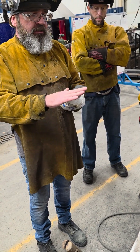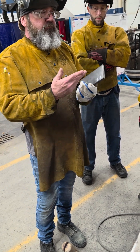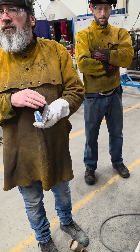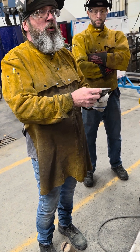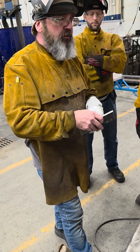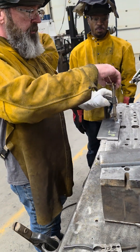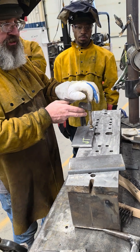You might clean all the dross off on the bevel first, and now you've got a burr on the back. So when I build them, I take a glove off and feel to make sure there's no burr on the backside before I put it together. Then wrap it in, take off that burr, and grind back about half an inch of the mill scale.